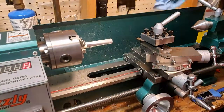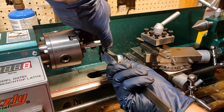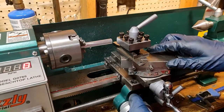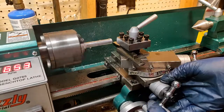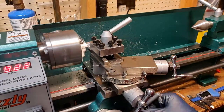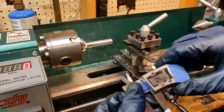If you look closely at the work you can see some of the original surface finish of the part as it was shipped to me. Because this was a very light pass and we barely scratched the surface, I will take some heavier cuts here in order to get myself closer to that final dimension. I am still using the power feed at this point to help improve my surface finishes. From this angle it does appear that I'm getting quite close to the chuck with the tool, but remember the video is sped up and I'm keeping a close eye to make sure I don't crash the tool.